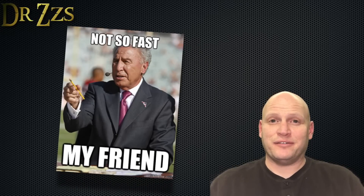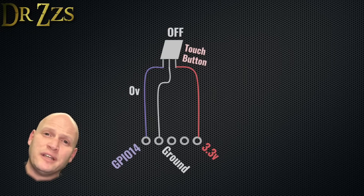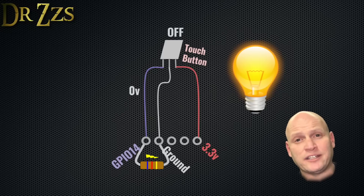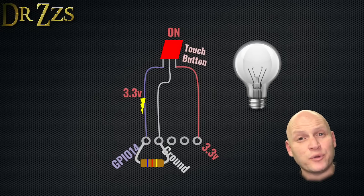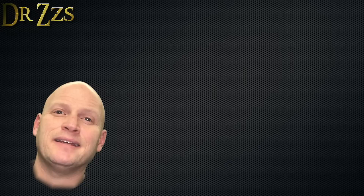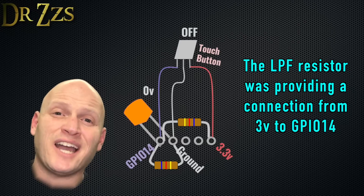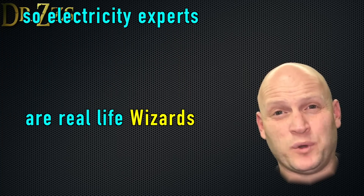Before getting into assembly, there's one important thing to cover. In order for the touch module to work as a button, we need to use a pull-down resistor. The pull-down resistor goes between GPIO14 and ground. When there's no external voltage coming into GPIO14, current flows from GPIO14 to ground, which activates the relay. When there is voltage coming into GPIO14 from the touch module, GPIO14 stays high and the relay is off. Unfortunately, to make the touch module work as a button, we have to remove the resistor from the low-pass filter — I found this out the hard way when I connected everything and it wouldn't work, but pulling that resistor out fixed it.